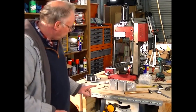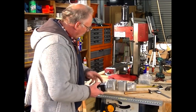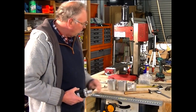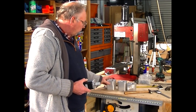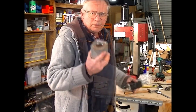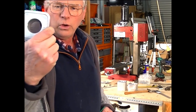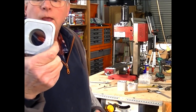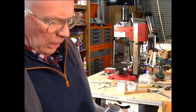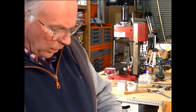These are the three mounting extensions for the stepper motors. This particular one is the Z — the stepper operates like this. They are a common design but three different sizes. This is the Z, this one is the Y, and this one is the X. The Z just happens to be the largest. You can see its construction — it's very solid and very square. I've actually machined slight flanges down inside there, so this will go down so far and stop, and it's absolutely square.